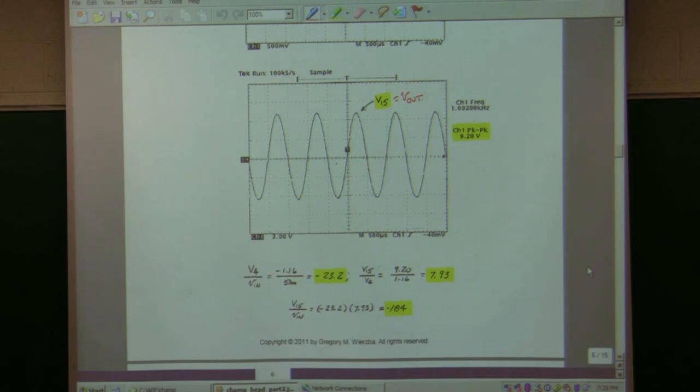I'm using generic models for the tubes. I'm always suspicious whether the specific tube I got is a little bit different. I'm using a data sheet from the 1950s to get the data to do these things, and it could be that it's quite different. I'd like to be able to measure tubes if I can. Dylan's not here, but we were talking about making a curve tracer so we could extract parameters from that. He's got some of the ideas sketched out, and so maybe in our project we could take a look at this semester, maybe next semester.